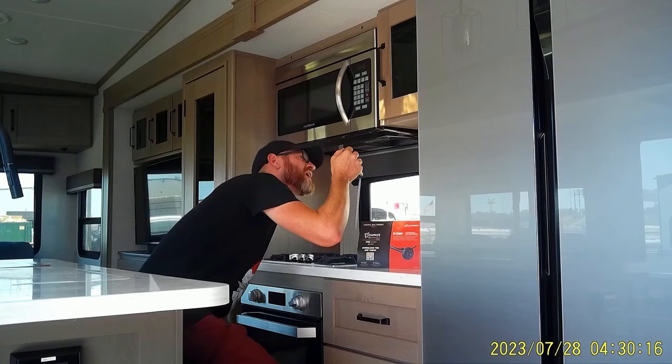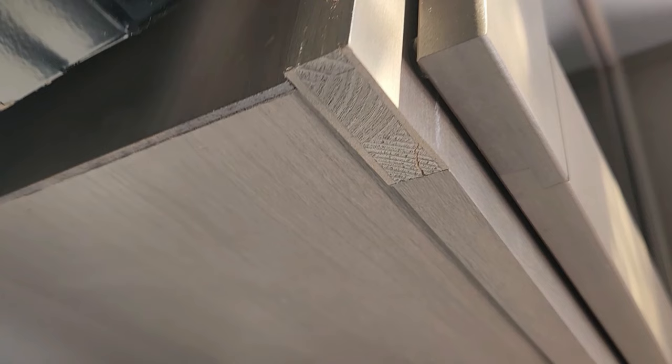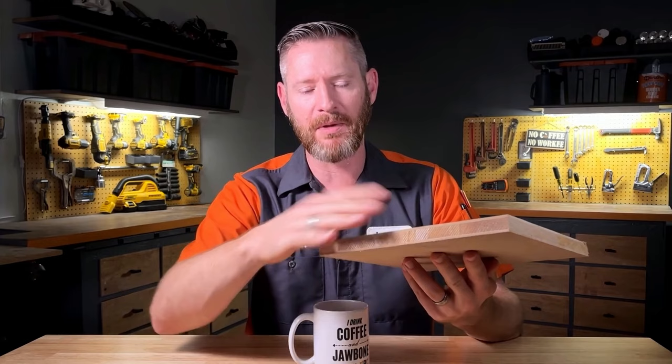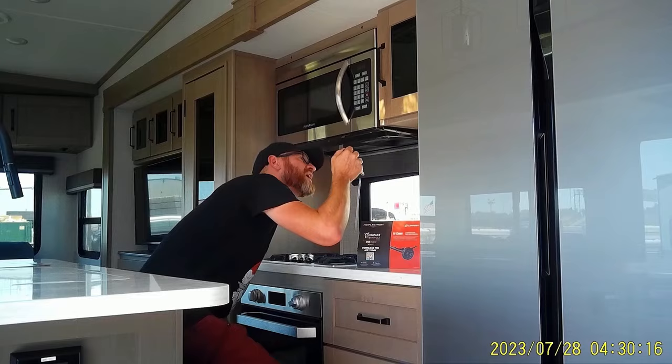The next questions in the app are going to help assess the quality of cabinetry in the RV. These RVs have solid wood doors — that's the best quality that you can have. With the cabinet boxes they've stepped it down a little bit in quality using something called lumber core, where the middle is just sticks or boards and then they laminate it on either side. You still have some chance of water getting in and swelling the edge, but it's nowhere near as bad as if the entire board is MDF.